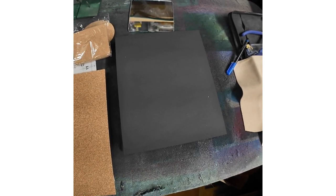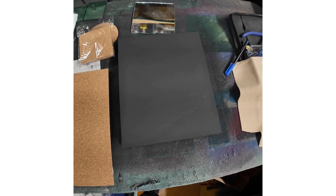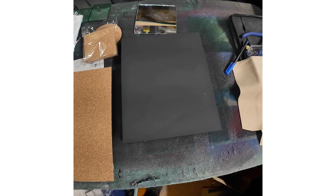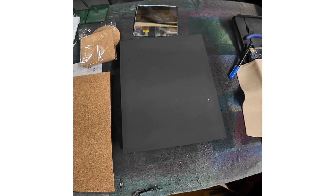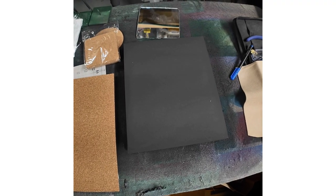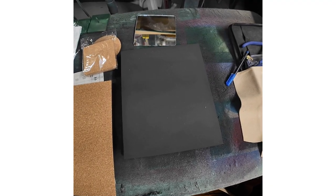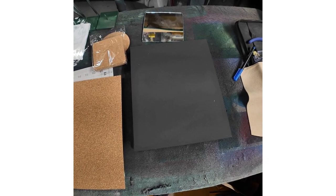This is a piece of glass that we've treated with black tempera. We'll go do some work on that probably later today and try several different image types and several power settings. And this was done again with the high volume, low pressure spray detail gun. And I'm finding that by letting this dry a full 24 hours as opposed to using it when it appears to be dry, which is about 15 minutes, because it's a mix. I mix this tempera with isoalcohol to help it dry faster. I find by letting it dry overnight, it somewhat hardens the paint. And so the harder the paint, it seems the more clear any type of engraving or patterning that we put on the glass is. So again, we're going to continue to experiment with that.